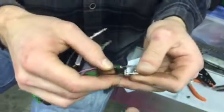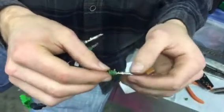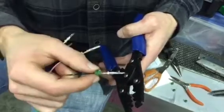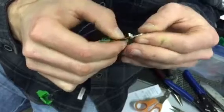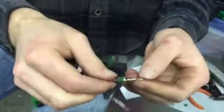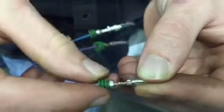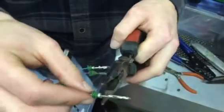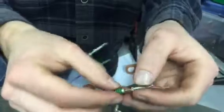The next step after this is recrimped: you'll slide the grommet up and then crimp around it to hold the grommet in place. I want you to maybe unpeel that one and not have one shorter leg — you probably don't have to cut the wire, it might slide. And then that's it — it looks like this, and then the crimper doesn't quite close it up enough, so I use some needle nose pliers to manually squeeze it just a little bit on either end so it overlaps and gives it compression.